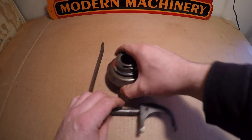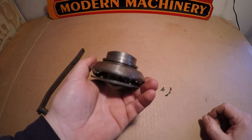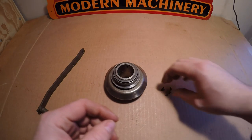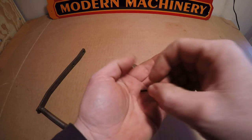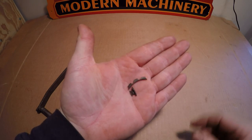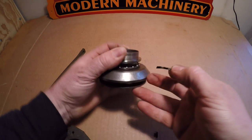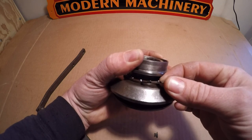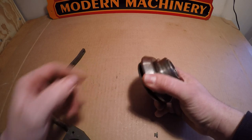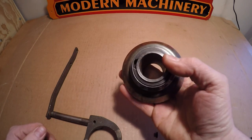Back to the bench, I've already been through the entire governor cartridge. I had it all apart, cleaned it up, and really didn't find anything wrong inside it at all. It looks like it's been replaced at one point, and I believe I know the reason why. When I cleaned out the engine crankcase, I found what looks like pieces of a failed bearing, and the only thing I can find that they resemble is the thrust-bearing on the backside of this governor cartridge. So perhaps that is the reason why this unit is in such good condition compared to its surrounding parts, but really no drama here, so I'm not going to waste any more time on it.